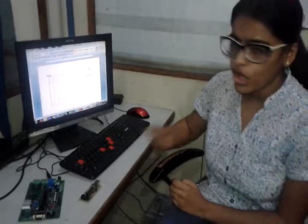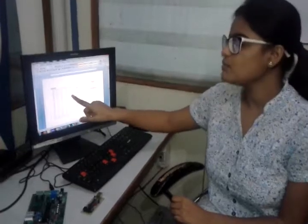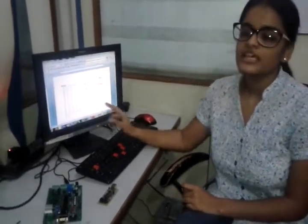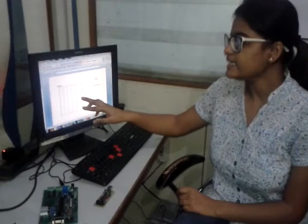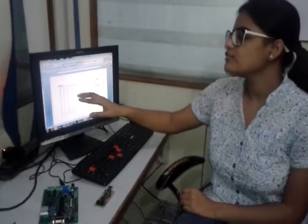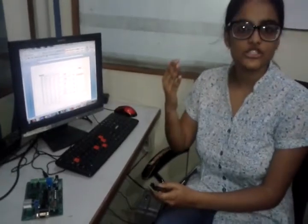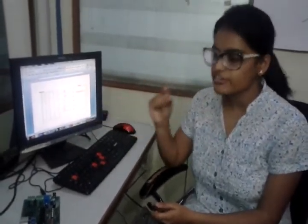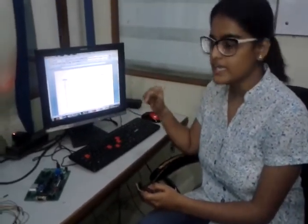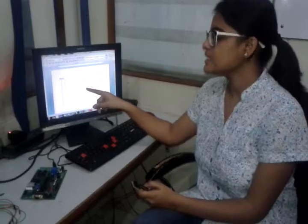All we need to do is connect the MISO pin of the master to the slave, the MOSI pins, the SCK that is the serial clock pin, the SS pin, and the reset pin. The master sends clock pulses from the USB programmer to the microcontroller, and with every pulse, every bit is transferred from master to slave and from slave to master via the SCK line.